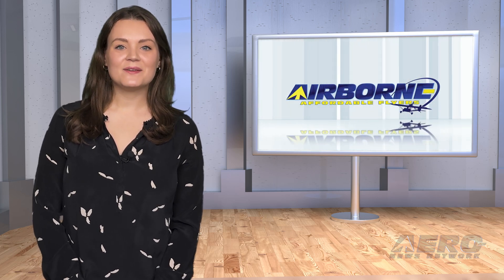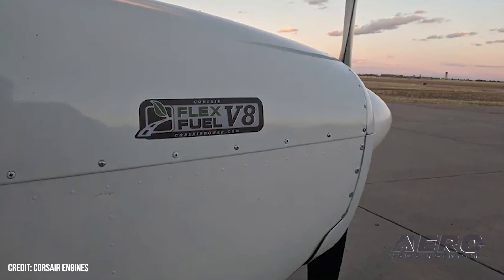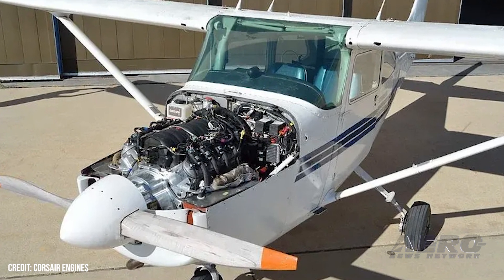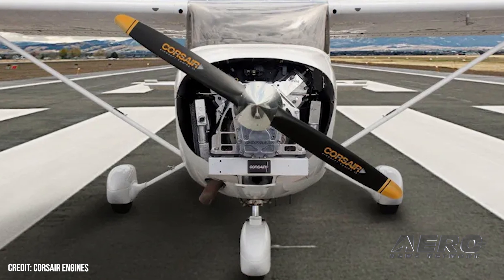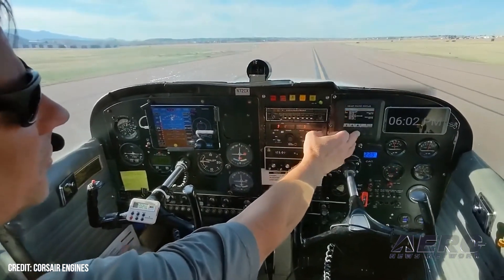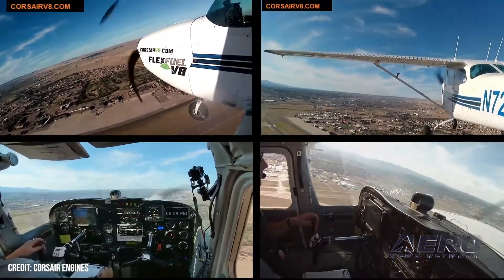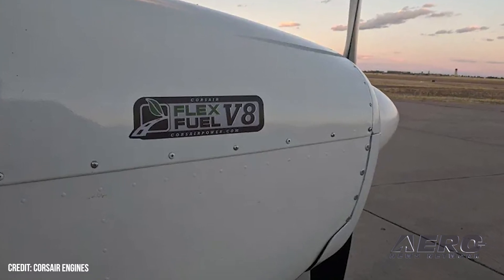That's it for today's trip around the patch. Let's get back to the rest of the news. Corsair Reimagines Piston Aircraft Engines. Corsair Aircraft Engines in Colorado Springs wants to bring a replacement aircraft engine to market that may reduce cost, noise and emissions. The engine features a modified aluminum V8 engine block with significantly modified components, including a redundant fuel injection system — essentially a FADEC — that monitors ambient temperatures and pressures to deliver optimum engine efficiency. A digital smart engine display replaces all analog gauges and displays fuel flow, fuel consumed, and fuel quantity along with alerts. A system-matched electronic prop gear drive matches prop speed with engine output to optimize performance, efficiency and noise. The engine is certified for several fuels including MOGAS, minimum 85 octane with or without ethanol, and has been flight tested more than 400 hours in the Cessna 172 with all fuel types and hundreds of induced failures.